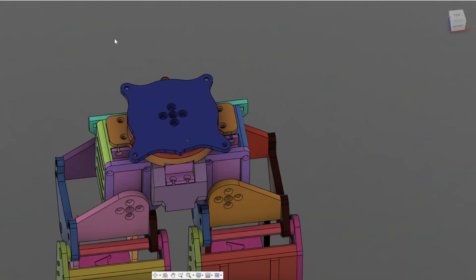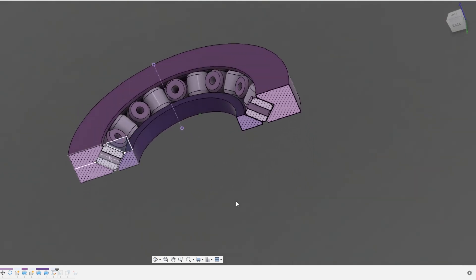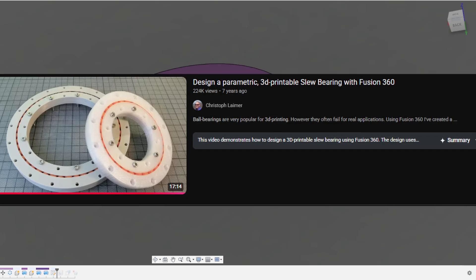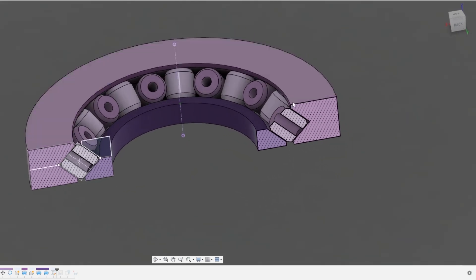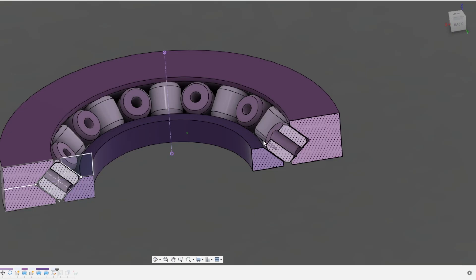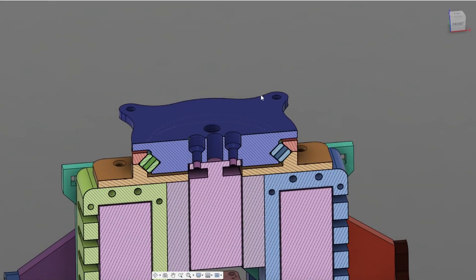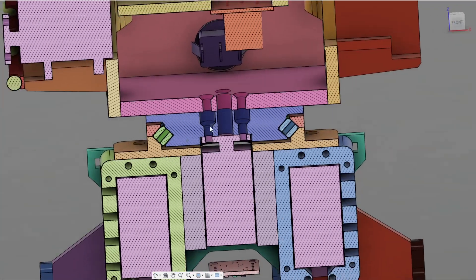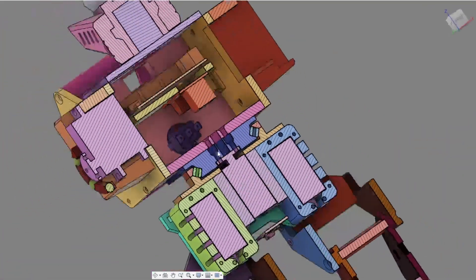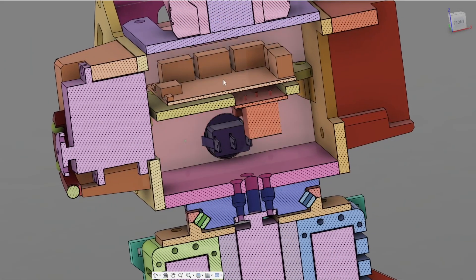To address this, I designed a new piece to secure the two halves together. Inside is a cross roller bearing, which you can see a bit better in this example. This design came from Christoph Lamer on YouTube, who makes some pretty cool 3D printed stuff, which I encourage you to check out. The idea behind the cross roller bearing is to alternate the cylindrical rollers at 90 degree angles, and this allows the bearing to handle loads and moments in multiple directions, unlike traditional ball bearings. So I adapted this design to fit on the pelvis assembly. The centerpiece rotates with the pelvis servo and is fastened to the torso through screws mounted on the bottom — you can see two here. This also allows me to separate the upper and lower halves if I need to, without needing to go into the internal electronics area.